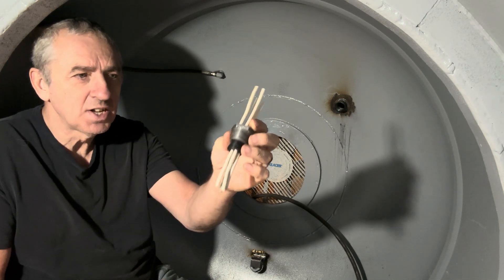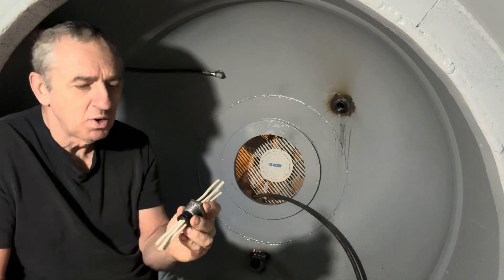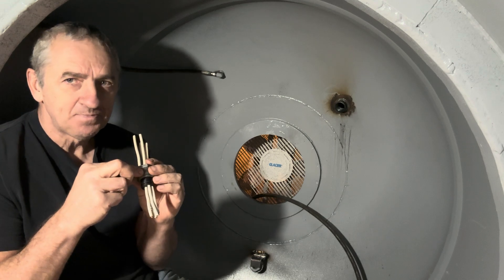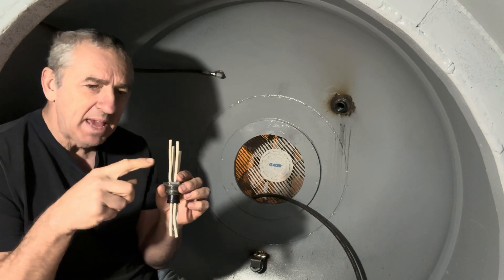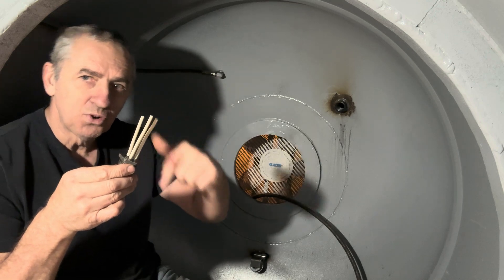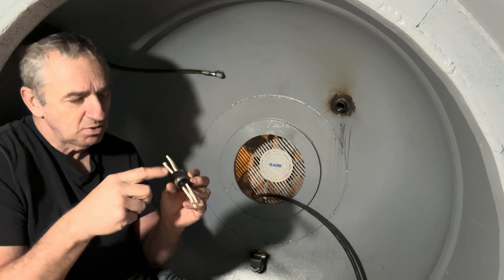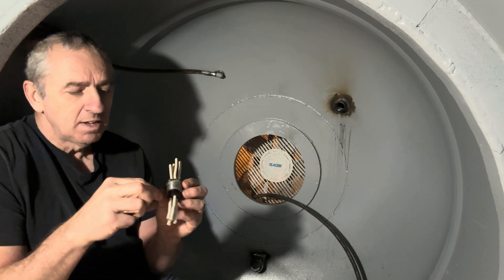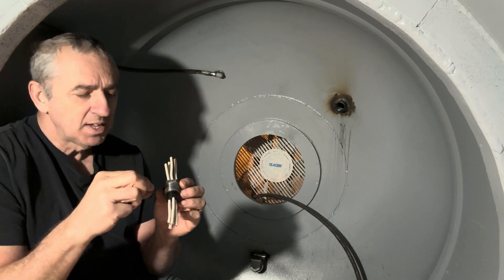This one is solid core wire going through the resin, so you have to strip off a bit of the plastic shielding so the copper is sealed into the resin. Another thing I do is put a little bend — a little S or Z shape in the copper — so the wire isn't just going straight through.